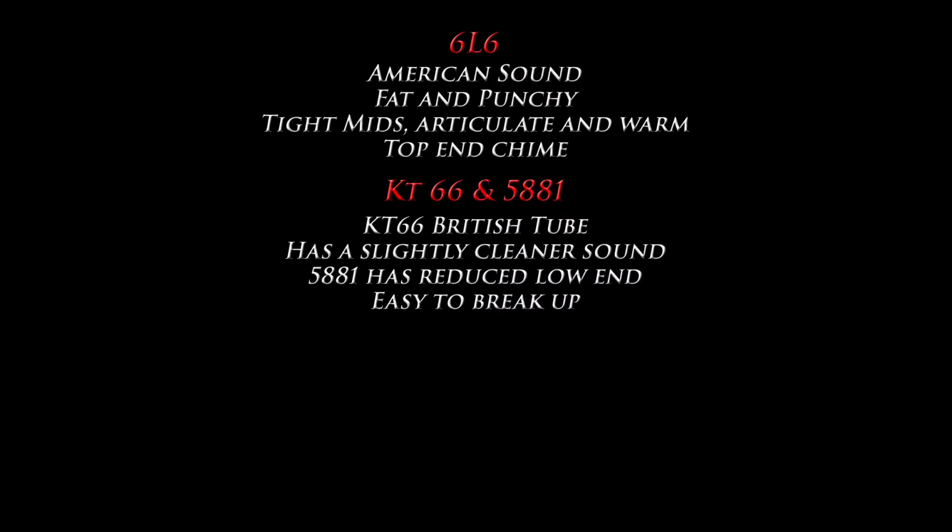All right, now there are some variations of the 6L6. You have the KT66 and the 5881. These are common substitutes for 6L6s. The KT66 was actually Britain's answer to the 6L6. And what you can do is you can put a KT66 in place of your 6L6.